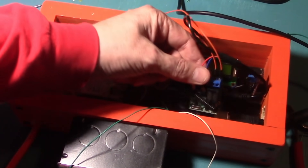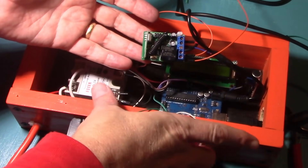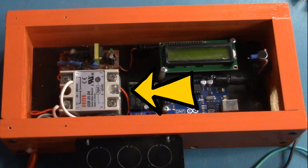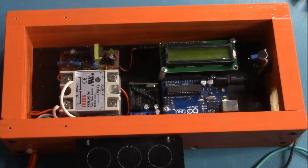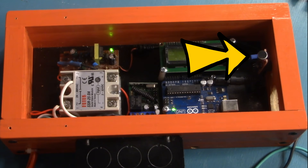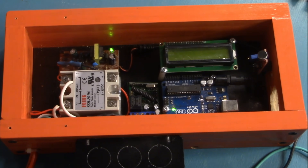Now I just have to build the very elaborate system to turn it on and off in multiple ways — and that's exactly what I did. This is the wireless control module, being wired in now. It will share space with the liquid crystal display, Arduino, and other components inside the box. Here's the relay, the 9-volt power supply for the Arduino, the Arduino itself, the liquid crystal display, the radio control module, the microphone, and we'll pass the USB cord through to program the Arduino.